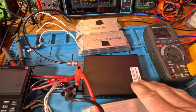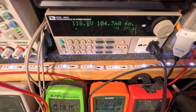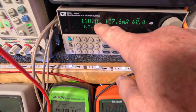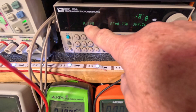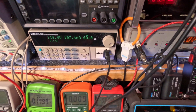With the amplifier turned on but not running — no signal input — I don't know if you can see that, but it's about 115 volts, kind of jumping around. Power factor is about 0.7, kind of bouncing around, and we have about nine watts. That's at the input with nothing running.